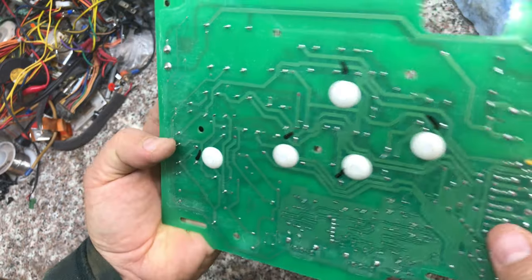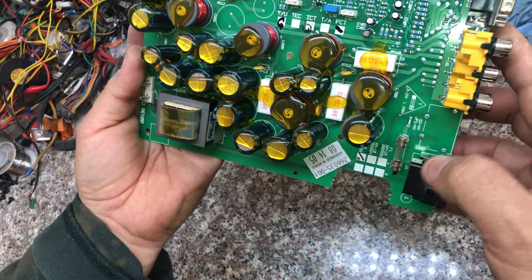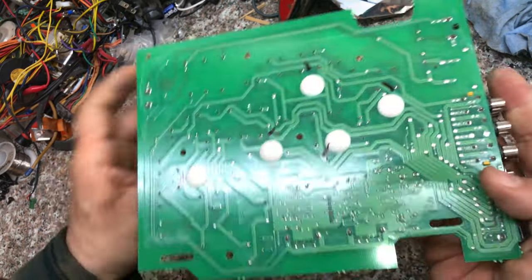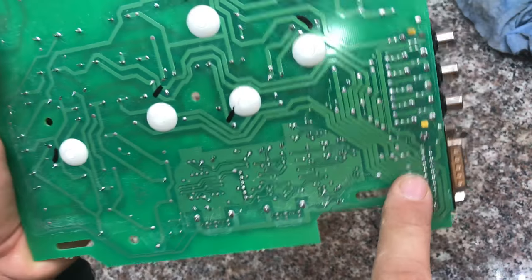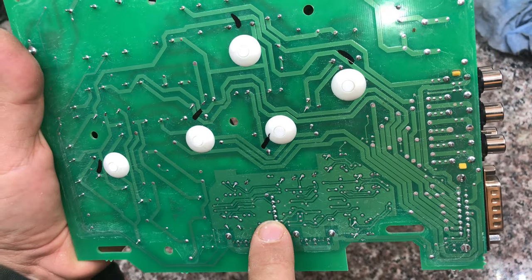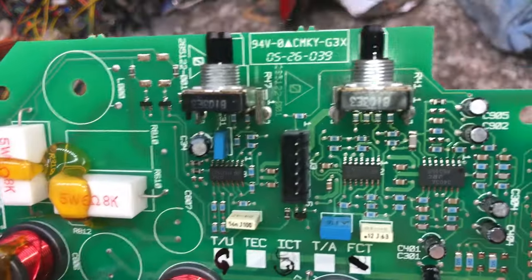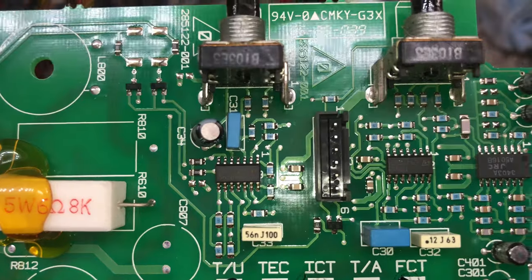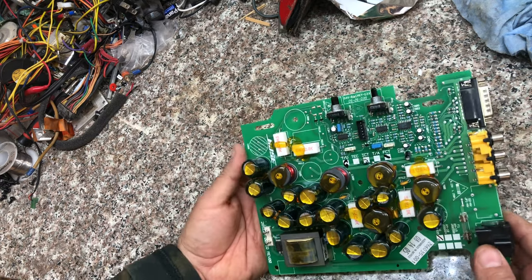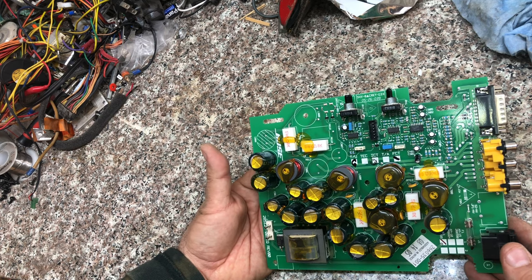Here is the AC input. I don't see any switch, so I'm guessing there is a triac here. The subwoofer is either always on or it gets turned on when you plug something in. The traces lead to operation amplifiers — some for preamplification, some for mixing the left and right channels, and some for filtering out the subwoofer frequencies.